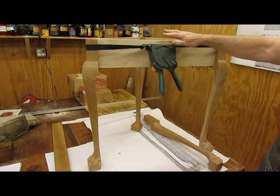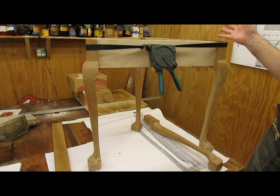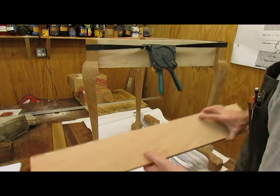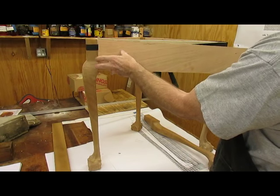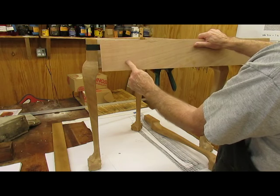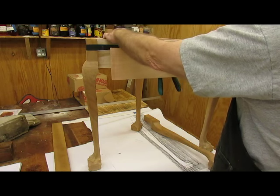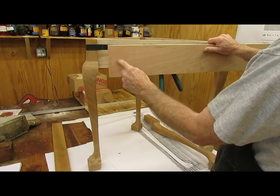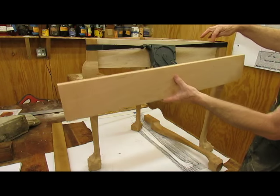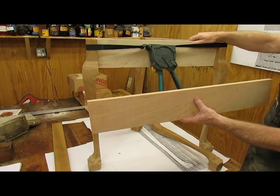This rear piece here is a piece of soft maple, placed in at three-quarters of an inch thick — it's not really ever fastened directly to the sides. The way it's done is I'll take this piece of cherry, put a tenon on it and a mortise in the rear piece, cut a short piece, put the hinge on it, and slide it in. Then this piece will be glued to the back piece — maybe I'll put a screw in it. Likewise, there'll be a short piece on the other side tenoned in, and that piece will also be glued to the back piece — that's how it holds in.